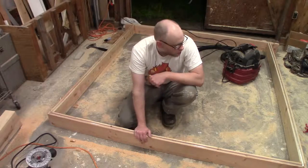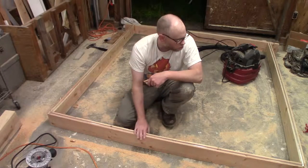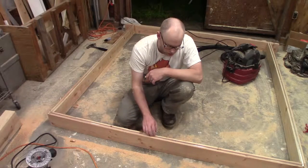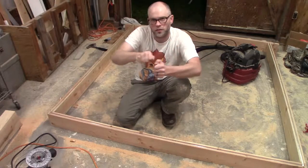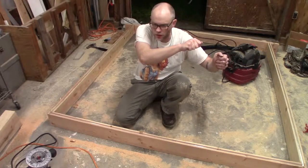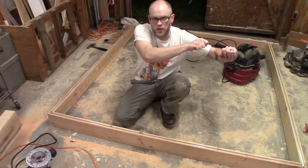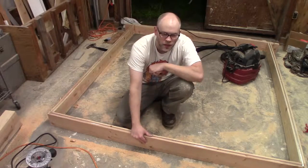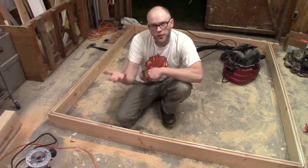All right, so I got all the aluminum in on the foot and the sides for the LEDs to mount to. Went fairly well. Didn't encounter any major problems. I did find that it was best to start at one end of the aluminum and tap and sort of iron along as it went in. That just helped flatten it out, because if I'd go along initially and get it in, it would sort of be wavy, and so starting at one end and ironing it along made sure it was flat. It's a nice tight fit, which is what I wanted. As you saw, I put a little bit of epoxy on some spots just to help.